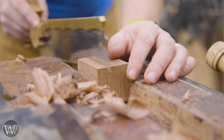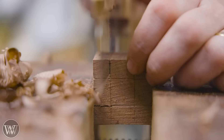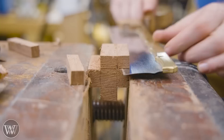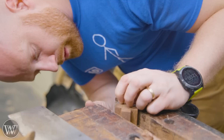Once we rough cut, we can plane it down and smooth it into the square — about two inches by two inches. I want to turn this into a cross cross-section, so I'm going to lay out with a marking gauge running all the way around from all four sides and then start cutting down to it. Using the dovetail saw allows me to rip directly to those lines, then I rotate it a quarter turn and the next cut basically turns it into a rabbet cut. We're going to repeat this all the way around until we get this star pattern. Some people make these flat from three-quarter inch stock — I like to make it out of the star. It looks cooler and feels good in the hand, but you can make this handle whatever shape, size, and style you'd like.